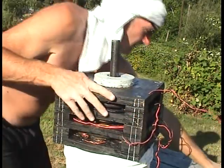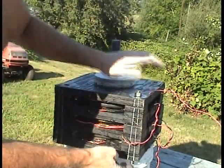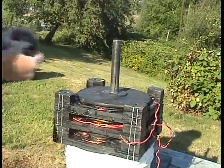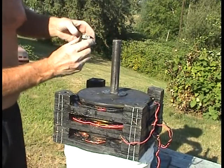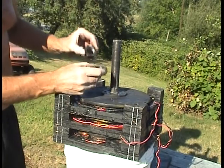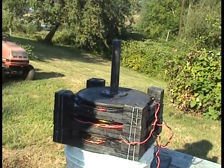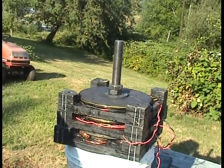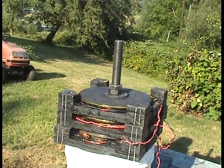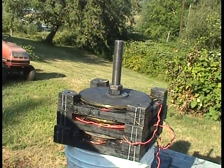Going down, I have these half-inch stainless steel bolts and they come down at every four corners. There are also a couple of steel nuts that go all the way down here, and these butt up against the bearing so there's no axial play to it. Here are the two nuts — tighten them together. Filed this down a little bit curved so it butts up against the bearing nicely.